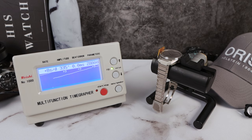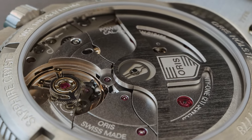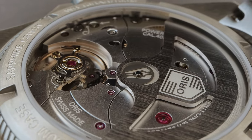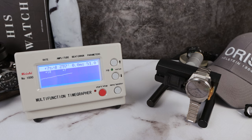So it should do well. Let's call it plus 8 — powerful amplitude, no beat error. We're going to test 12 down to see that positional variance and how it's going to react on the wrist. Plus 8 dial up. I'm expecting much lower now to hit that rating of plus 5, minus 3. Ignoring the first number: 7 then 6 — much better. 0.0 beat error, very nice. Amplitude is still unbelievably powerful. Plus 6 on the final round.